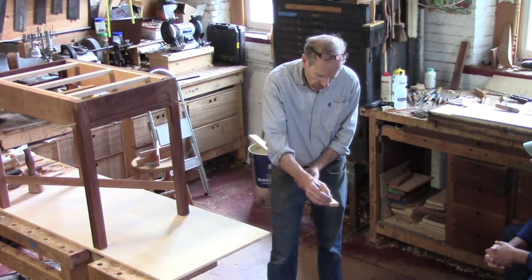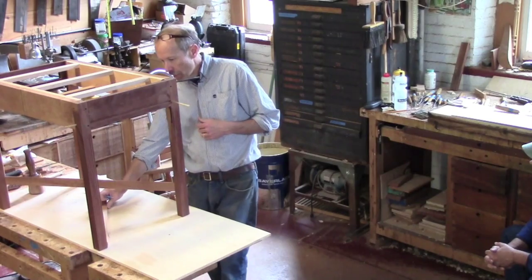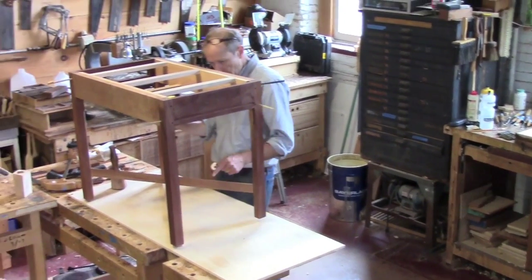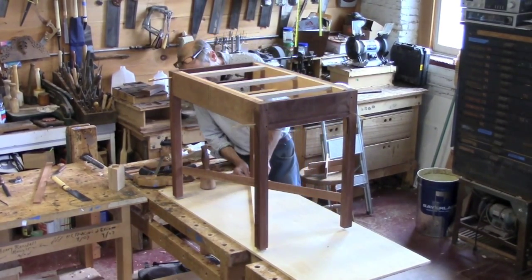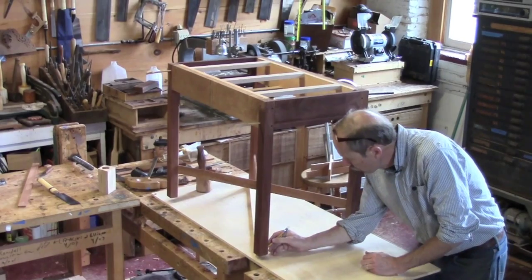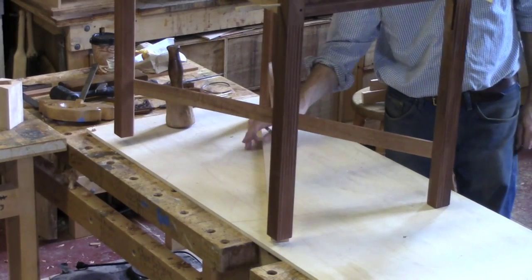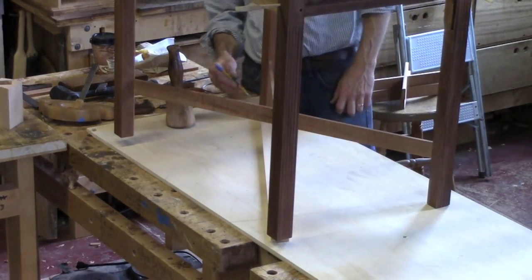This is just a mock-up. When you set this up, you line it up with your chamfer on the inside of your leg, so those marks line up with your chamfer and your piece is centered underneath your stretchers. Then you take this thing, set it up the way you want it, and mark it from your leg. Keep track of which leg you marked it to. I put A and B on my drawing, always face my table the same way, and put A and B on my stretcher parts so I could always put them back in the same spot.